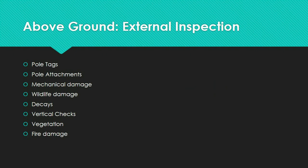We also need to look for decay. Sapwood that is very loose or ragged, anything above one inch, must be reported because it poses a climbing danger to a lineman. Inspectors should look for pole-top rot evident when there are losses throughout the outer circumference or indentations along the apex. Section loss, surface corrosion, and evidence of decay surrounding bolt holes are all signs of cross-arm decay and should also be recorded.